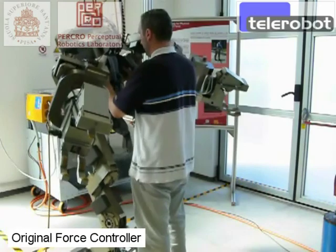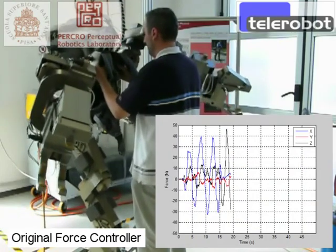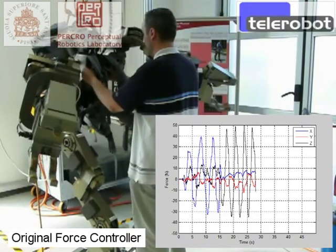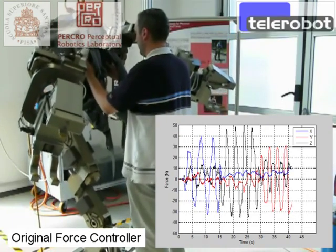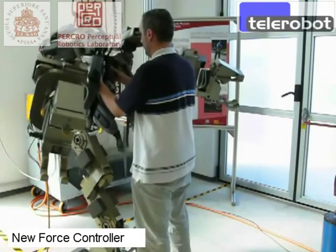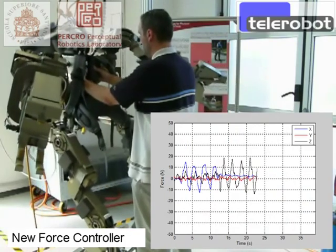The trunk motion tracking test was carried out with both arms held in fixed posture by a rigid position controller, while the new force controller was enabled for both legs with both feet in contact with the soil. Optimal distribution of the global force acting on the body extender between the two legs was used, and the inertia matrix of the whole system reduced at the leg joints was computed for this interaction case. The decrease of the resistance force is significantly less than in the previous tests, being in the range of four to five times, explained by the significantly larger inertia moved by the legs and the higher Coulomb friction due to the relatively high joint torques required to balance the weight of the upper part of the body extender.